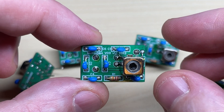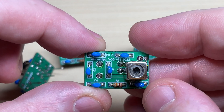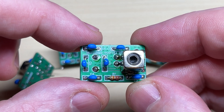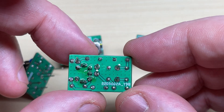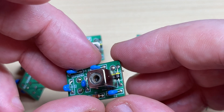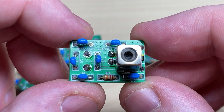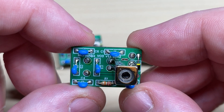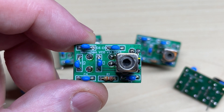Here's a closer look at that VCO. As you can see it's a quality double-sided board with ground planes both sides. Plenty of via stitching and quality capacitors and components on the board — no expense has been spared in making this. All those capacitors are from Digi-Key. Coils are obviously handmade by myself.